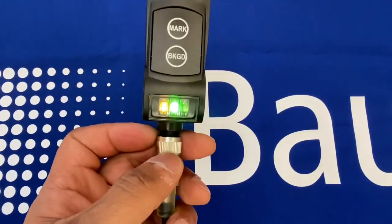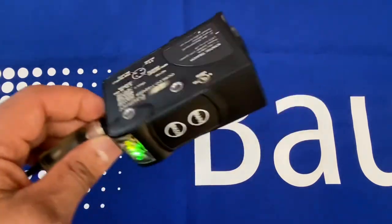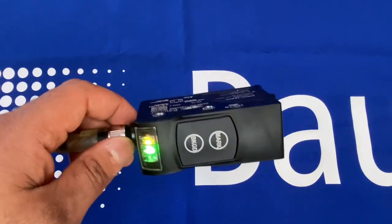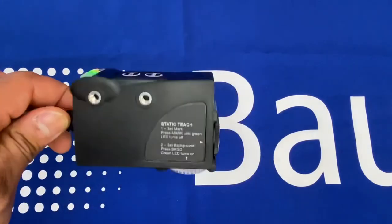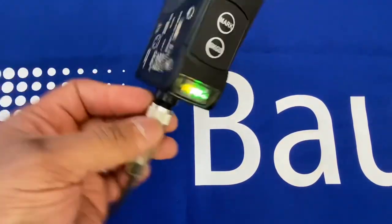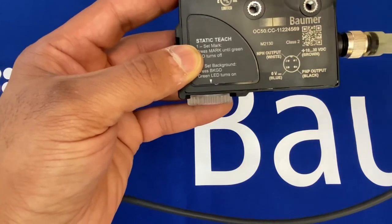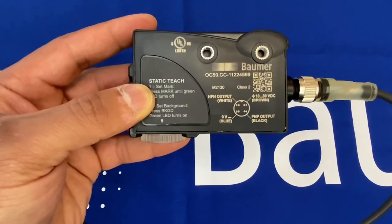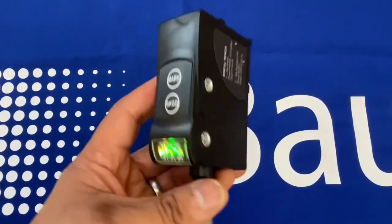It has a fast response speed of 33 microseconds with optional 20 millisecond delay activation on the output — perfect for print mark recognition in printing or packaging, and for controlling processes in label and tag position, cutting, gluing, and folding applications. Super simple to mount in a pretty industry standard size. The unit has both PNP and NPN outputs on board: pin 2 is the NPN output and pin 4 is the PNP output. One model does all — super simple to set up, very interchangeable, and easy to teach.